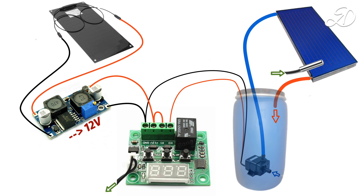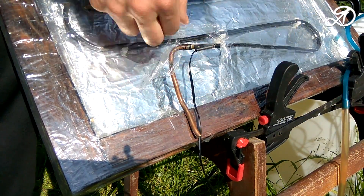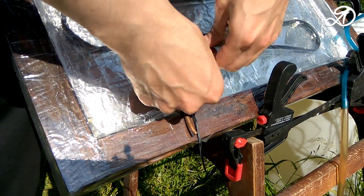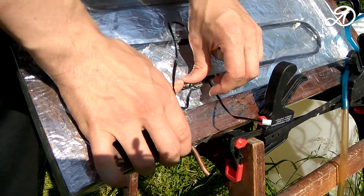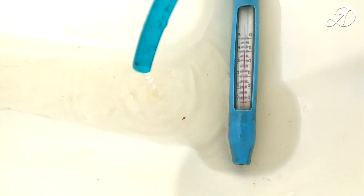Here is another scheme where water circulates in the same container — this method is also ineffective; we need to use a thermos tank. We'll install a temperature sensor in the solar collector — I just taped it to the coil. For the sensor it is desirable to make an additional hole in the frame, or you can do it next to the radiator outlet and seal with hot glue. As I said before, the pump must be connected to the other end of the condenser coil.